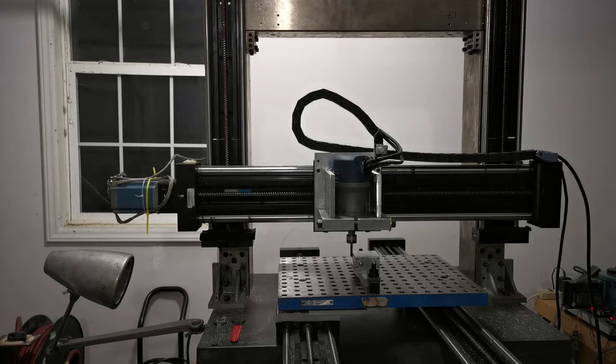The first test was done with a 1/4 inch carbide roughing end mill that I purchased a few years back. This is a surfacing operation at 50 inches per minute, a cutting depth of 20 mils, and a spindle speed of about 7500 rpm. There is horrible squealing vibration, and it did not matter whether this was run at 10 mil or 20 mil cutting depth.